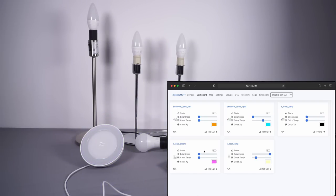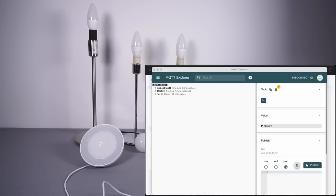What that means is this is now all automatically working over MQTT. Let's take a look at that using MQTT Explorer — free software that connects to an MQTT broker and lets you issue commands manually without needing Node-RED right now. Here we can see Zigbee2MQTT showing up as one of the topics — there's the bridge showing information about it being online, what devices are connected, and all that sort of stuff.